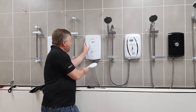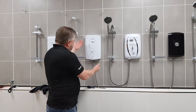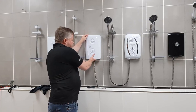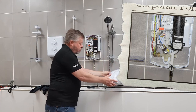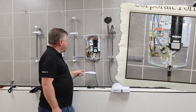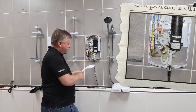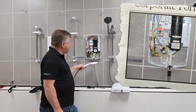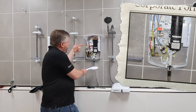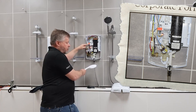So where do we start? I've taken out the screws already — let's show you what's actually happening inside the shower. I'll put the power back on and turn the shower on again. That part there is your mechanical indicator. Normally, if it was working properly, that would be up in that position and you wouldn't see any orange in the window.